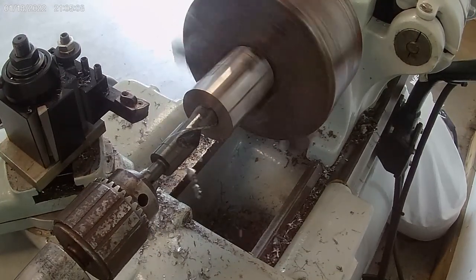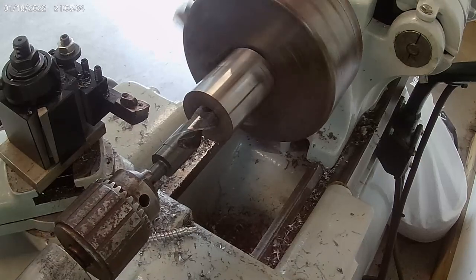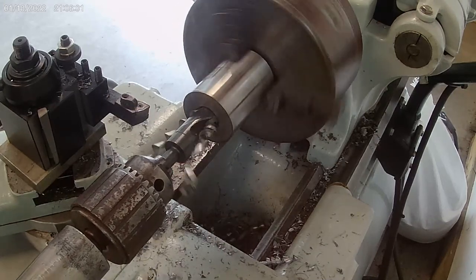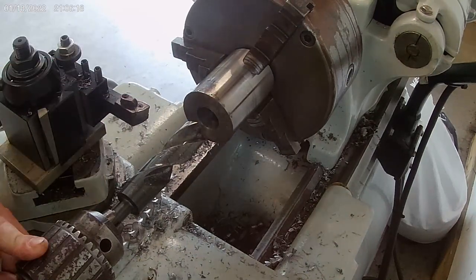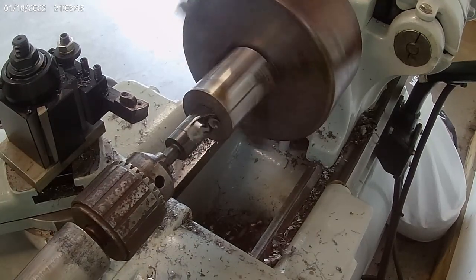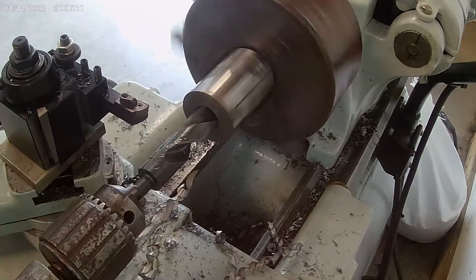So as I said earlier in the video, this sleeve was problematic for me. It started at this point trying to drill some of these holes you'll see coming up. The chuck started spinning on its taper, because there was some oil that found its way in there. I had to clean both those tapers out. And then the bit started to find a bit of a hard spot and chatter, which it hadn't done previously. So it was sort of a precursor of the things to come.